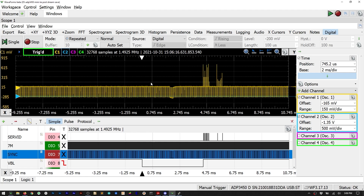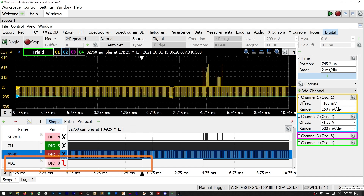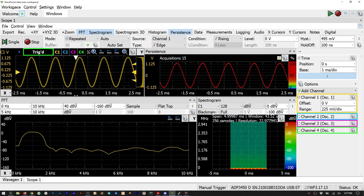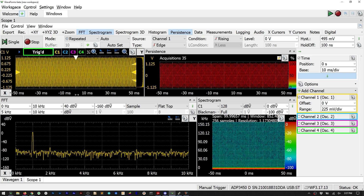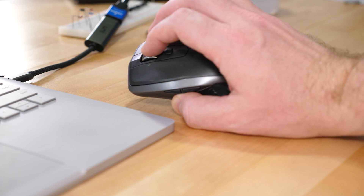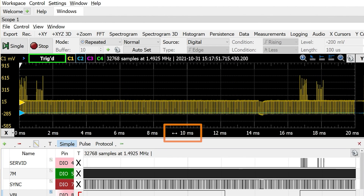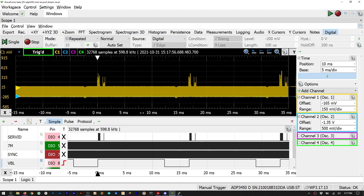Because of the integration, the oscilloscope can also be triggered from other instruments. For example, I have several digital channels being sampled along with the analog waveform where the trigger is actually a digital signal, but everything stays correlated in time. Many features are available that you'd find on more expensive oscilloscopes: FFT with spectrogram, display persistence, data logging, multiple cursors, and a good assortment of automated measurements. The mouse scroll wheel is context-sensitive, and even though I prefer physical knobs I found using it very intuitive for scope functions.